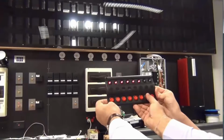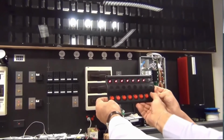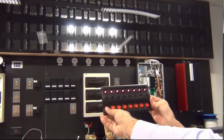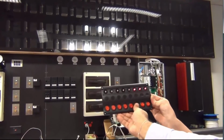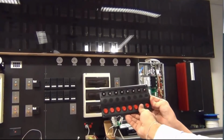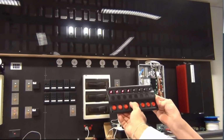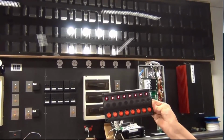Lastly, test the device. After commissioning the DLLI8I8O dry contact interface in Envision Project, test the switches to ensure that the device is properly configured to the assigned logical area and logical channels. The LED indicators for each switch should light up to communicate current system status or settings. In this example, the 8 switches have been assigned to 8 individual channels on Area 3, and they should illuminate accordingly.